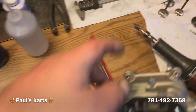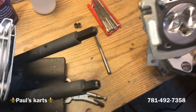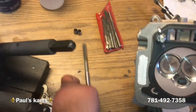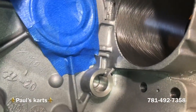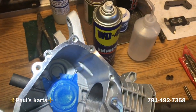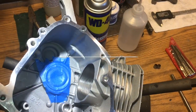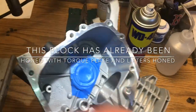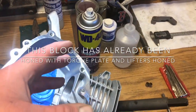The clearancing has been done. I used this style burr here — single flute egg. The reaming on the dowel pins is done; used a standard 10 millimeter reamer and drill bit. After that, I wiped everything down with acetone and then immediately with WD-40. You want to just keep wiping it down — first blow it out with compressed air, then wipe down with acetone and WD-40, and keep wiping the bore with WD-40 until your towels come out clean.